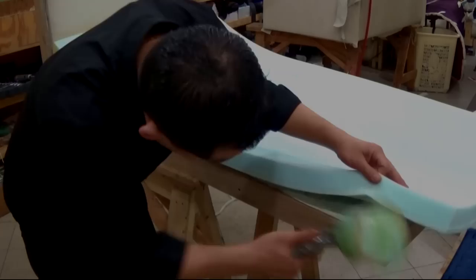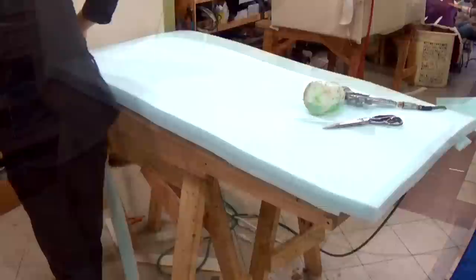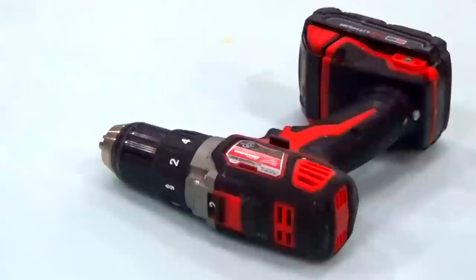Now I'm gluing 2.5 inch medium density foam. For the sides, I'll be cutting 1/2 inch bigger than the frame. And for the top part, it's a little longer because I have to fold it and staple it at the back. So now I'll be using a drill like this and a hole saw